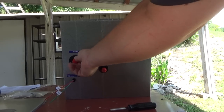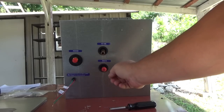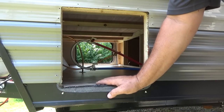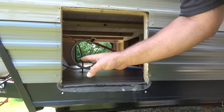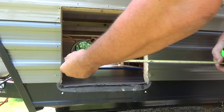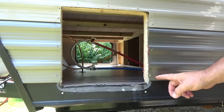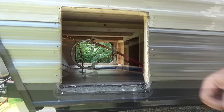I want to show you the fuel line connection — it should fit just like the other one and thread on here. This is our 12-volt DC positive and the green is negative, red is positive. This is our water connection — we have our hot out and our cold in right there, which will connect via SharkBites to the lines inside the RV. Our new unit, the Precision Temp, is 13 and three-quarter inches wide. The hole we need is 14 and a quarter tall. The current hole is about 13 by 13, so we're going to have to take some out on the top and side.